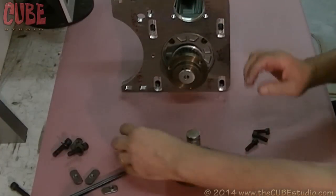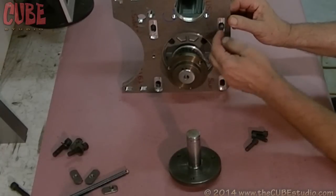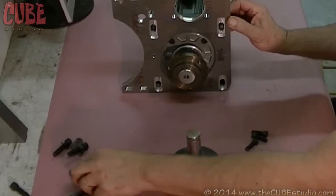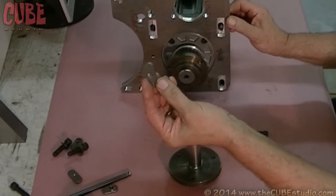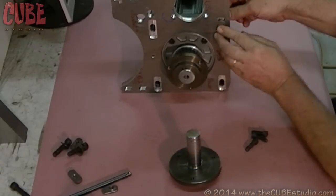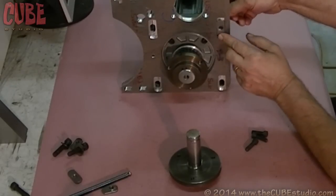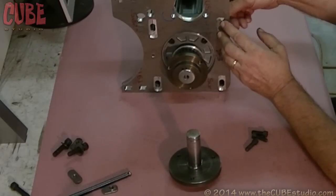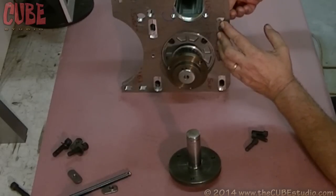The slots in here are to adjust the belt that runs from here up to the countershaft. I added these little drop-in nuts that you don't have to fiddle with — you can just tighten from the back side and they slip up and down in this little trough. I'm just putting this on here so that the plate doesn't keep falling off.